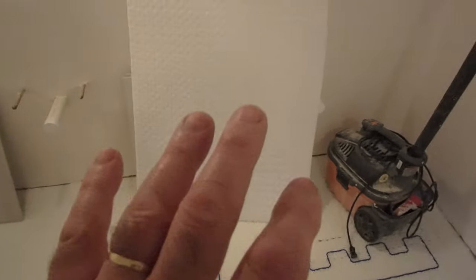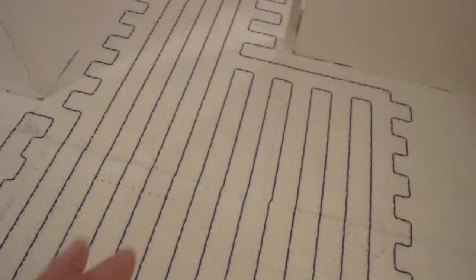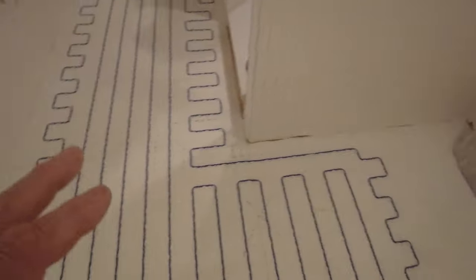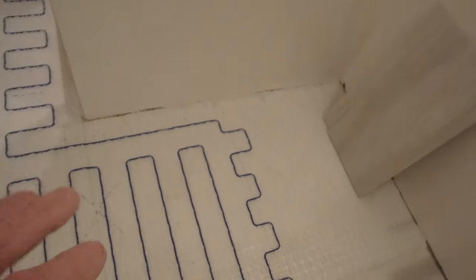Now, a little bit about the mat. The mat is an uncoupling membrane. I'm not going to go into the specifics on how an uncoupling membrane works. I have plenty of videos about that. I might link to a video about Strata Mat and how that works in the description. Strata Heat is an uncoupling membrane, and you get all the benefits of one. If you're installing over plywood, you want to make sure you use the proper thinset for a plywood or wood subfloor. I'm going to go into more detail on that in the video.